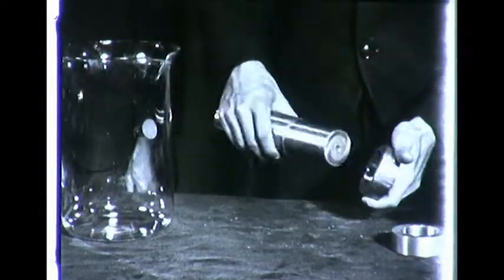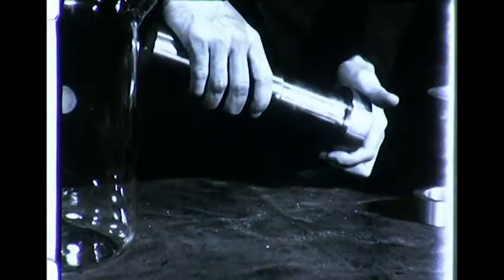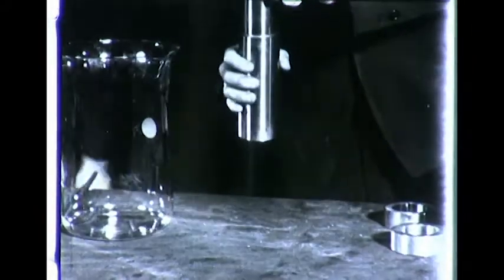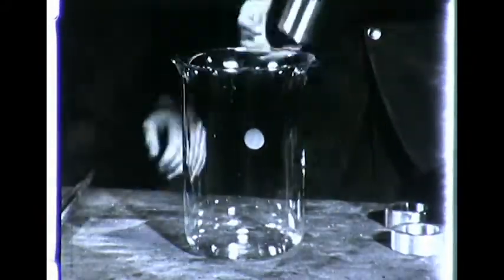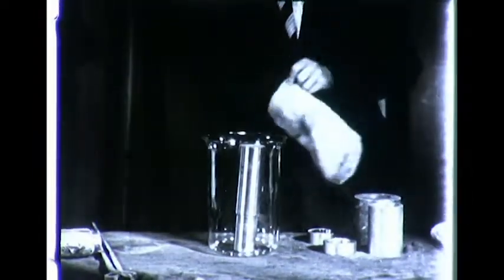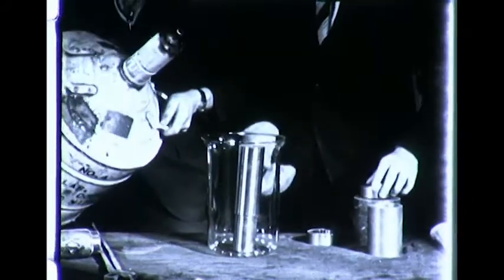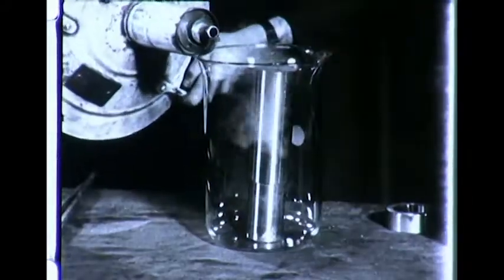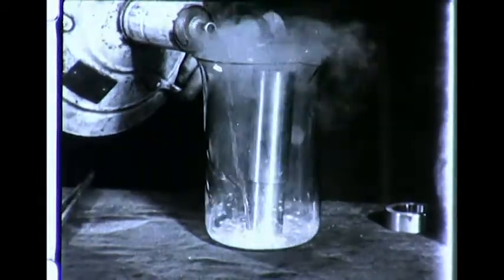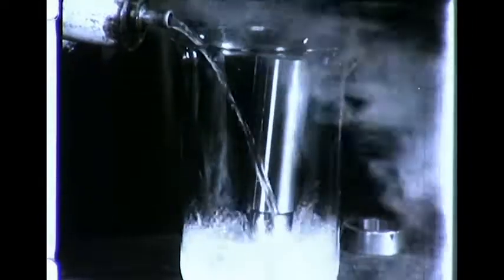Here's a practical use for this super cold. The outside diameter of the shaft is a thousandth of an inch greater than the inside diameter of the rings. A force fit between the shaft and the rings is desired. So liquid air is used to contract the steel shaft — to shrink it temporarily so the rings may be slipped on. This application is exemplary of the surge continually being carried on by science and engineering for new ways of doing things or ways of doing new things.